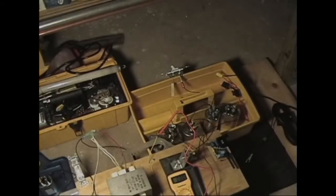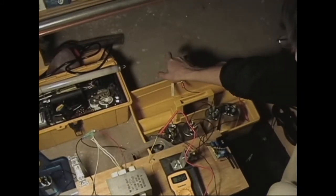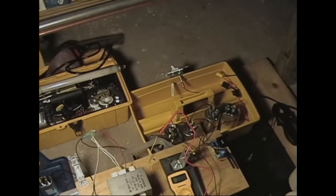On an important note concerning safety, whenever you're dealing with a rather large capacitor bank it's always good to have a safety discharge switch. Basically all I have is a light switch hooked up to a 5 watt 100 ohm power resistor, and it's all discharged. Of course I always check it with a screwdriver after I do it just to be really sure.